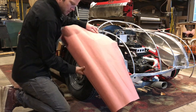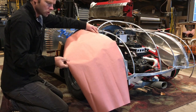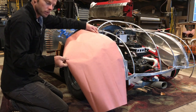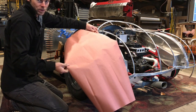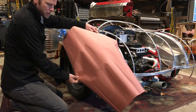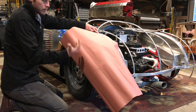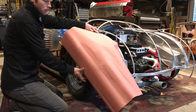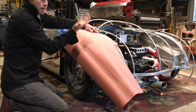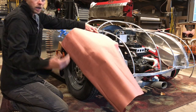Now all of this, remember, in shaping metal, we're either stretching or we're shrinking. With what I'm going to be showing you here, with this paper, it's going to be all shrinking. You can't really stretch paper or we'll tear it, okay? But by shrinking this paper down, slicing it up and bringing it together, it lets us know what needs to take place. We can then decide with the tools that we have, are we going to stretch by hammering or wheeling, or are we going to shrink by putting it on the tree stump,